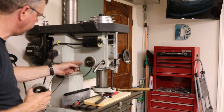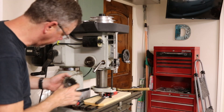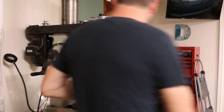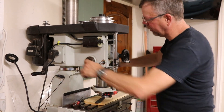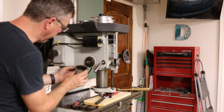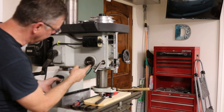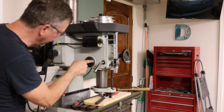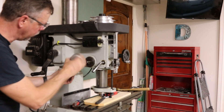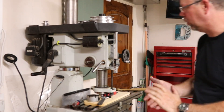So these screws have teeth. The coil has a hole in the end of it, and that goes over the top of the screw with the top of that worm gear. It's got a screw there that holds the end of this. As you put it back together, you probably run the screw through the end of the spring, wind this up by hand, and then use the little Allen wrenches here and here to hold the outer cover in the locked position you want — that gives you the proper spring tension. As you saw, the quill dropped. We're making progress.